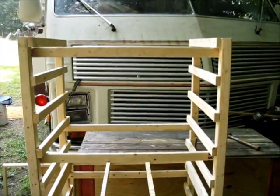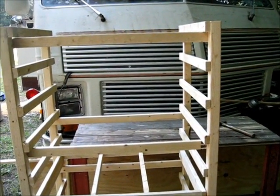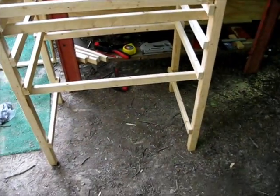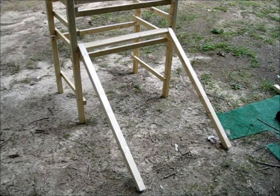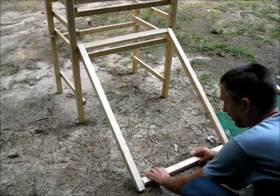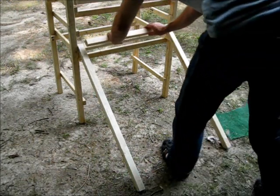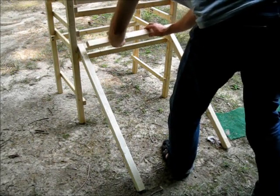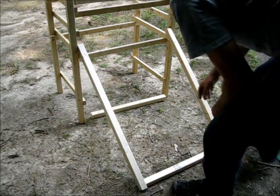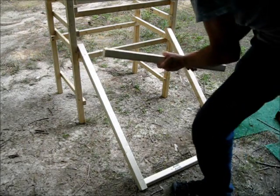So now I make seven shelves for this frame, and then I can cover it in plastic, put black on the backside, and then I have to make my solar heater on the bottom. There's the frame for the solar dryer. I'm just piecing it together now for size, just to get an idea. That'll be the solar dryer — it'll sit in here. I'll build a lip for it later, so I'm going to screw this together now.